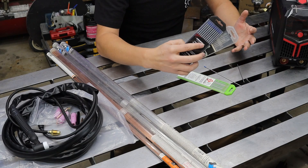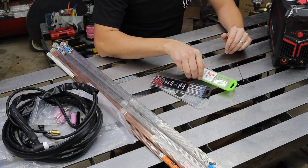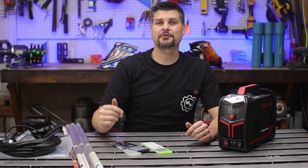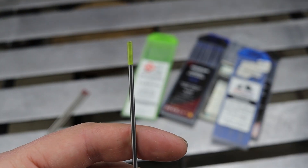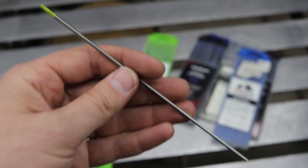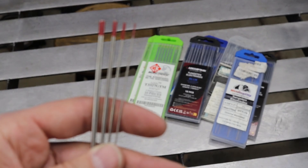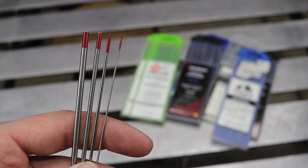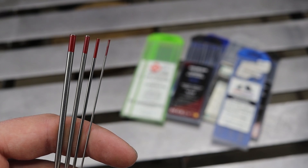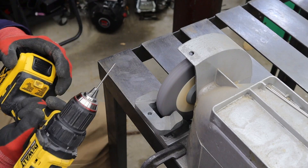For a while I've used gray or blue, and they still work great. I have a bunch in my stockpile. But recently I've found a color called chartreuse — it's like a little green, blue, yellowish. Either way, it's just another flavor of tungsten that can do both AC or DC, and it works great. For sizes, thinner material go on the smaller end, thicker material bump it up. If you want one general purpose size, 3/32nds is typically really all I use.